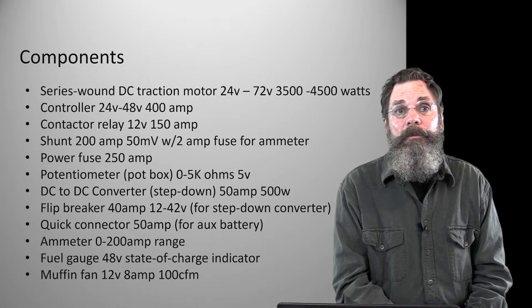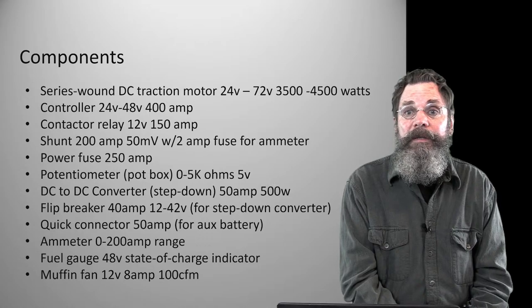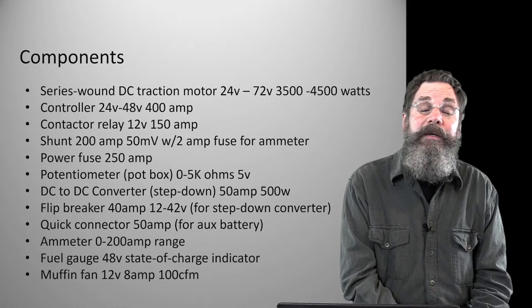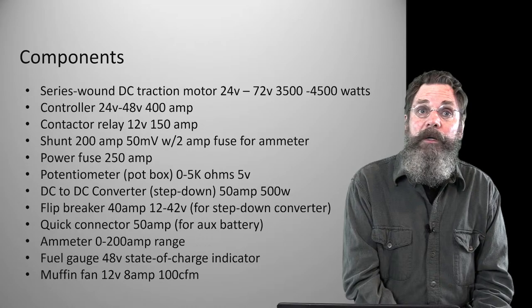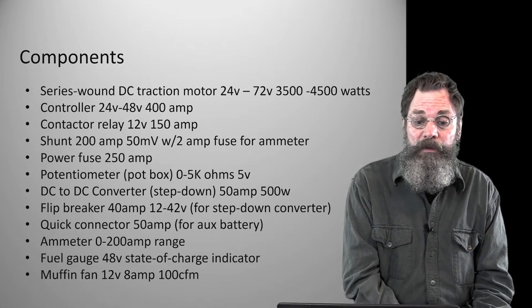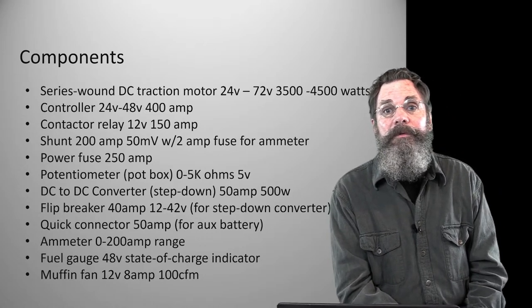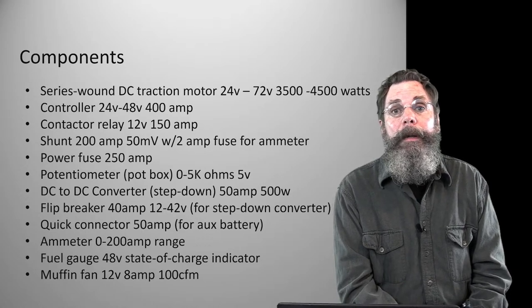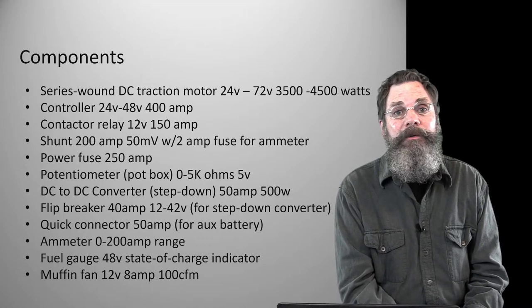The machine will still operate at 48 and below 48. But as we get down to a certain point, it taxes the components within the system. It taxes the battery, it taxes the motor. So we try not to pull it down too low, but you can use the fuel gauge, or the state of charge indicator is a better word for it, to gauge your consumption. And again, this particular one I got is not all that accurate,